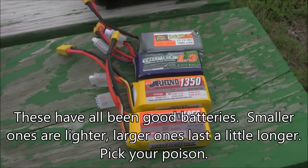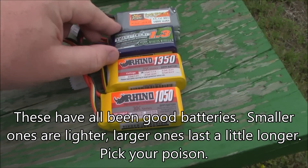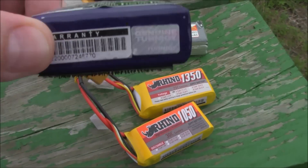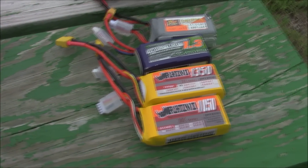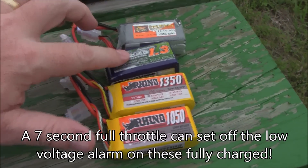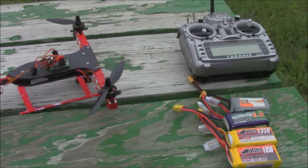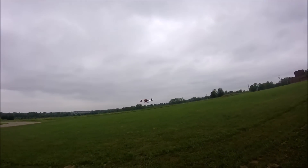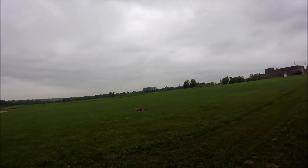The batteries I've been using are 1000mAh and 1500mAh 3S packs. These are the Nanotech 1.3 and they're rated 25 to 50C. They're getting a little puffy but that's just because I'm getting better at line-of-sight flying and pushing the batteries harder. These two are both new, and this one is well used and well appreciated.